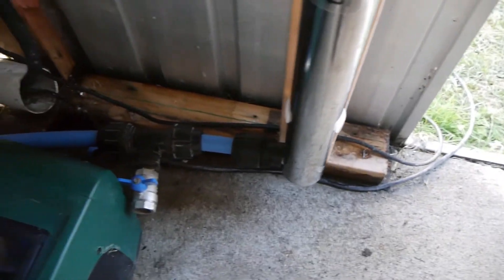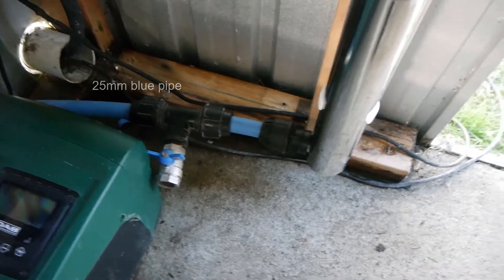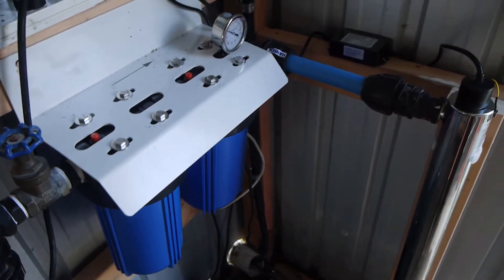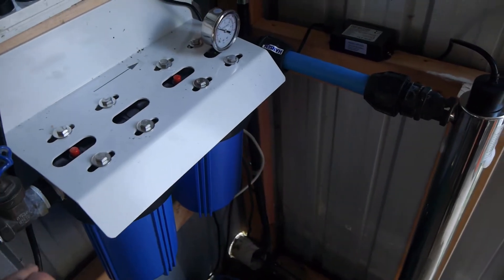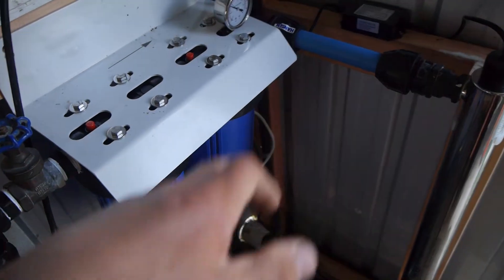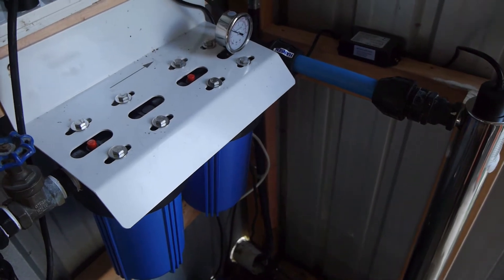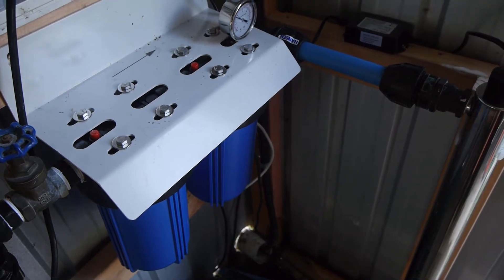The water then travels through there and down out the bottom here. I've got another drain-off valve there, which is quite important so you can actually service this unit. What a lot of people do is run a bypass circuit around the filters, so when they get clogged you can just bypass temporarily before getting new ones. I actually prefer to just keep spare filters on hand and replace them when it happens, so you don't get lazy and leave it bypassed.